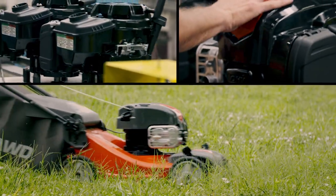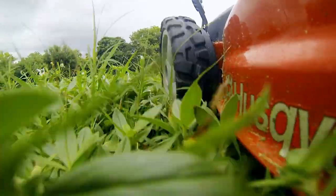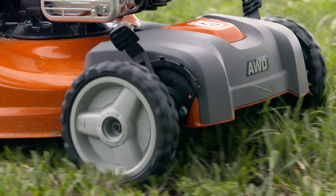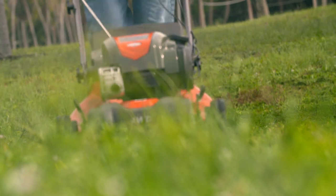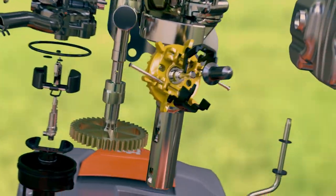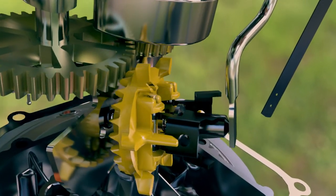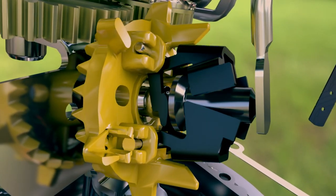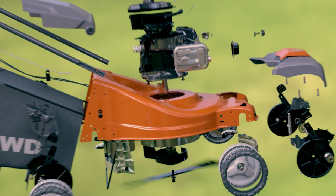These precision cast, super strong engines pack a serious punch. The engine turns the blade 50 times a second to pulverize the grass — if it slows down, the grass won't cut cleanly and the mower will clog up. So there's a hidden mechanism called the governor, the lawnmower's cruise control. It uses flyweights to detect blade speed; if the crankshaft slows, the flyweights decelerate, fall inwards, and trigger a lever to open the throttle and pump in more fuel, boosting power back to 3,000 RPM.